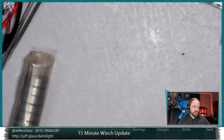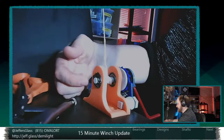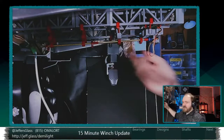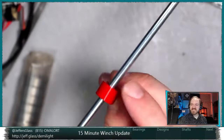So presumably this shaft will be supported on the near end by the actual coupling to the ratchet, I'm going to have to square my terminology up at some point, to the ratchet barrel here. So the shaft comes right out of here effectively. But it's also of course going to need some support somewhere else along the system, much like we did with these hooks for the Kabuki drop. And I picked 3/16 shaft for this new stuff that I picked up specifically because it is the same size as the brass rod we've been using. So in theory, we could repurpose our existing hook architecture. Might be kind of interesting, but it's not the least frictionful design. We mostly got away with it for the Kabuki drop just because that was a relatively low weight system.